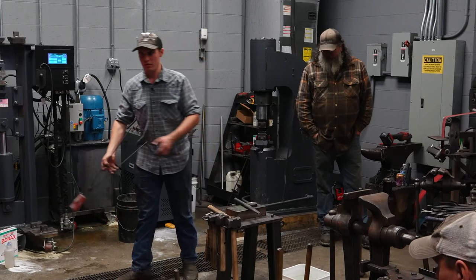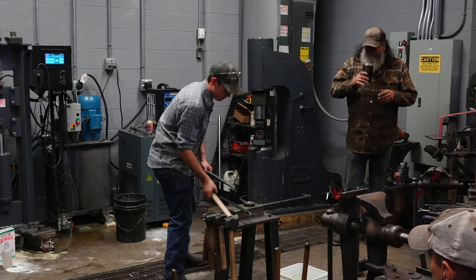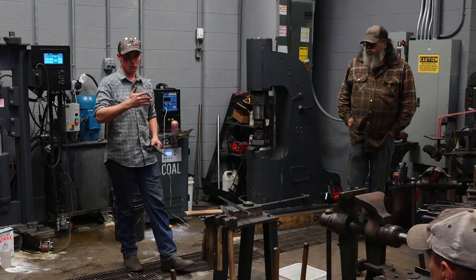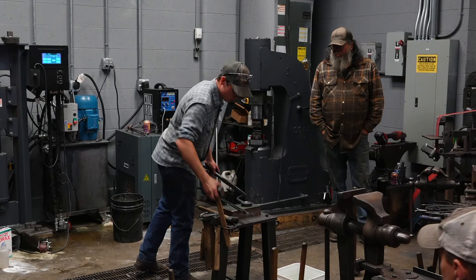So when we upset the hammer in the cupping tool with the drift in it, after we hit on the sides with the fuller, okay, so we forge the sides of the eye, don't just think about the surface of where we're forging the hammer, think about internally the drift and where that's contacting. So we forge the sides like this, and we forge the ends of the eye. So that's why we can have contact all the way around.